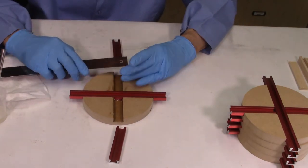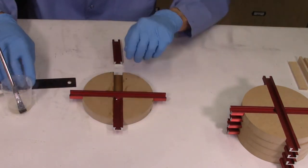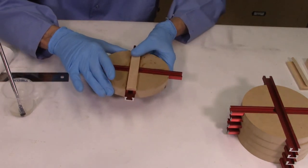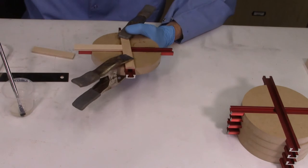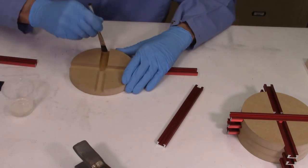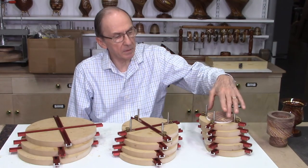I do not apply any epoxy to the outside one-inch edge of the T-slide channel that will overhang the MDF disc. I lightly press the T-channel slots in place and use a clean rag to wipe off excess glue. I then attach three-quarter-inch wide wood strips over the T-slide channel, taking care so they only contact the T-slide channel and not the MDF disc, and clamp with spring clamps. I use the same process to glue up the remaining T-slide channels in the remaining discs.